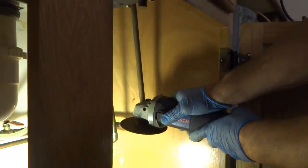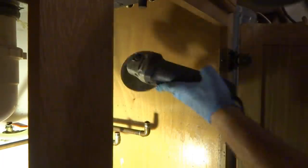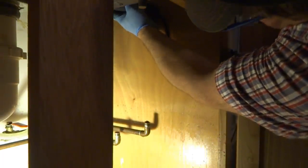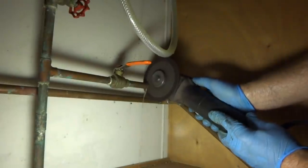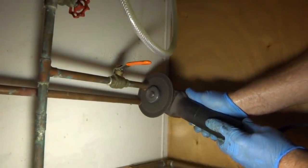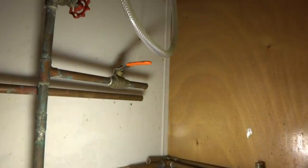So the electrician comes down the cellar. Did he see it burnt like this? No, this is after. He comes up and says look at that shit, it's all cooked. So the whole circuit breaker has to be replaced from the lightning strike. All the switches in the open position - you've got to put all new breakers in, the whole box. We weren't even going to check.